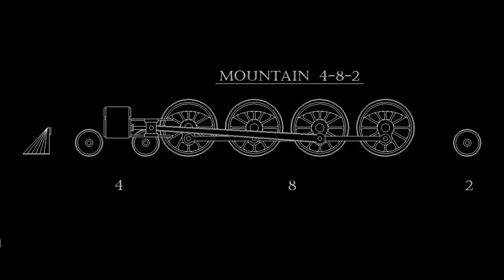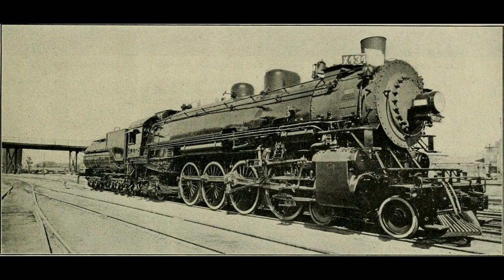In the first decade of the 20th century, railroads hesitated to adopt large locomotives due to potential weight and clearance restrictions, and since passenger cars were still the lightweight wooden variety, the 4-6-2 Pacifics were still able to move passenger trains at respectable speeds. By 1910, the Chesapeake and Ohio found it had to double-head passenger trains operating over the Allegheny Mountains, which prompted the railroad to look for an upgrade to its motive power. In 1911, the Chesapeake and Ohio took delivery of two 4-8-2s from Alco, making it the first railroad to adopt the type. The 4-8-2 combined the best qualities of the Mikado and the Pacific — eight drive wheels for better traction, and a four-wheel pilot truck for better stability at high speeds.